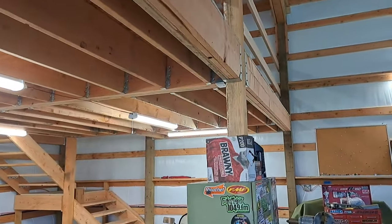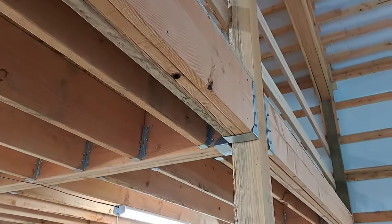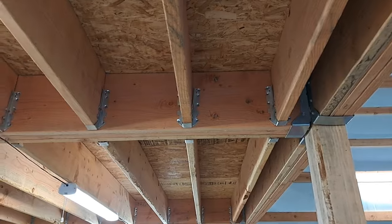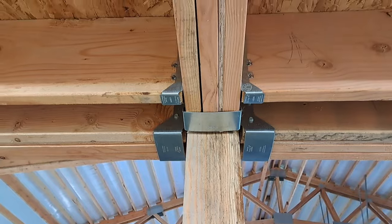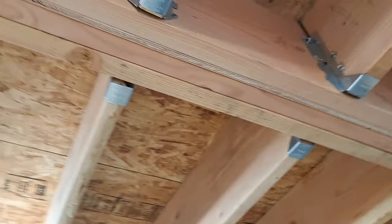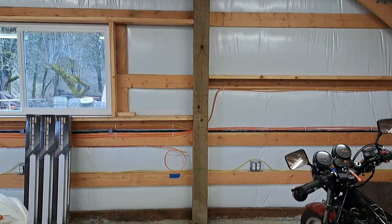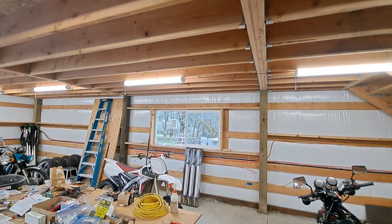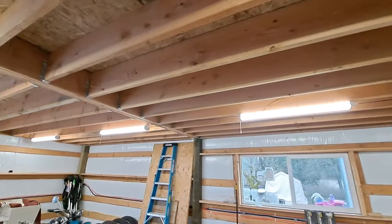Because my building is 40 feet in depth, I think these are roughly 12 feet on approximately three-foot centers. You can see it corresponds — it runs over, coming off each post three ways. It's a stack-up of those two-by-twelves with a piece of plywood, coming off each six-by-six post and running over to the beam at the far end of the building. Same detail on the other side — two-by-twelves, three thick, coming over to this post.